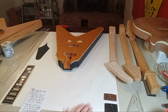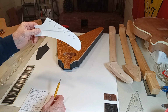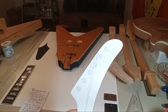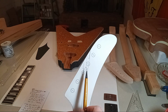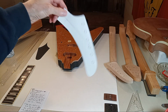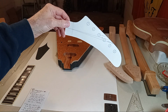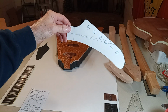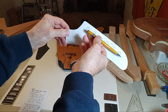It takes off so much stress, and it guarantees that if this thing really needs to be another eighth of an inch, well, then I need to add that wood back, or let the client know, hey, what do you think about my design? Because if you look at these lines right here in the center, and I'm going to geek out here a little bit for you builder types, that's the center. See, there's 3 lines there. The center line is the actual center line of the neck on my design. What that does, it takes all of the droop and it brings it up a little. I'm exaggerating, but if the actual droop is really about right there, I bring mine up about a quarter of an inch for my personal guitar. If you wanted to go with a Stratocaster, then you'd come up about another 10 degrees because the Stratocaster is not nearly as steep going down this direction right here.